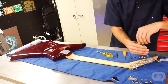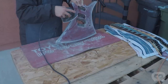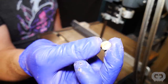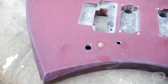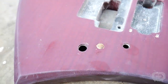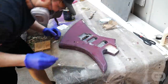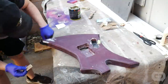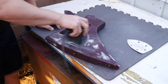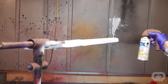Step one is to hand this off to my assistant Ryan, who begins disassembling the guitar and sanding it down. First thing for me is to cut up some 3/8-inch dowels and glue a piece of dowel into this hole — it's not straight and it's completely off center, so I'm filling that in and will be re-drilling a new hole. This guitar came with a ton of damage, so now I'll do some bondo to fill all the chips and dings, sand it all level, and then bring it into the spray booth to lay down a coat of white paint.